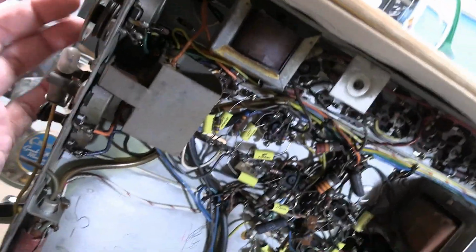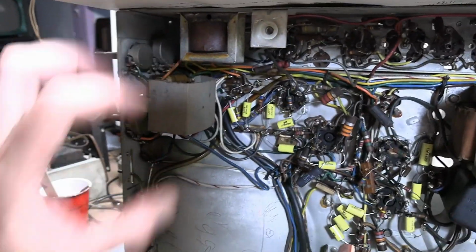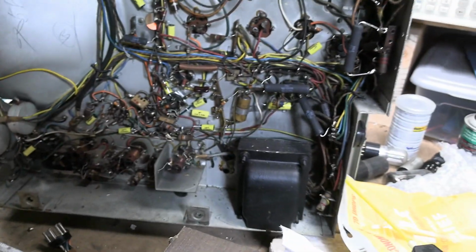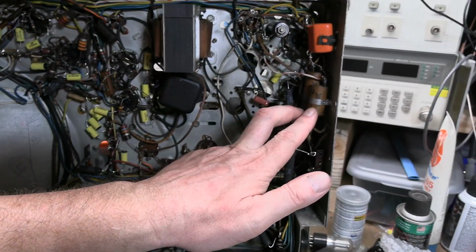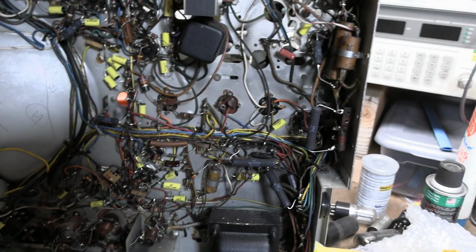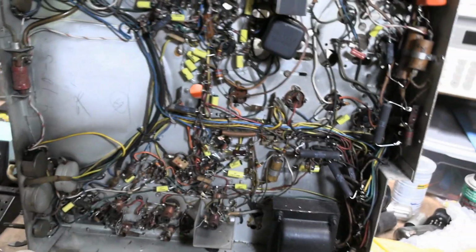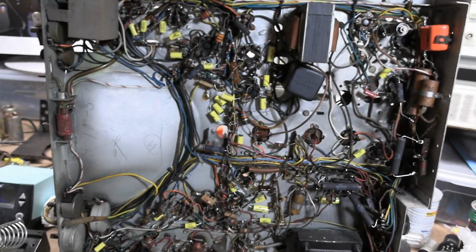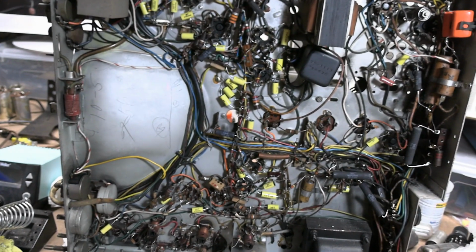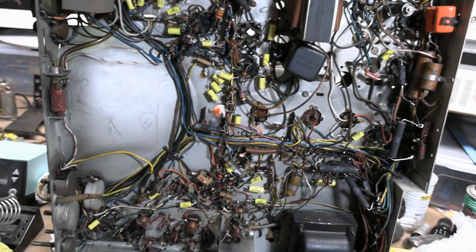So we'd have to take this whole thing apart, and that is part of the horizontal width, linearity, frequency conglomeration there. And these caps are the bypass caps for the horizontal and vertical centering electrolytics. Very low voltage, like 6 volt caps. So I am inclined to leave all those in place because they're hard to get at, or I don't have the right values, and I think they can handle it. They're not like the major power supply components.